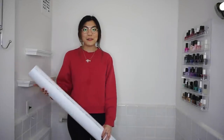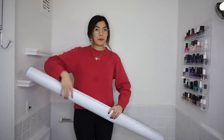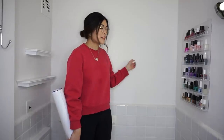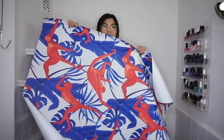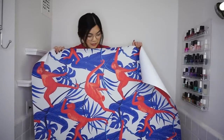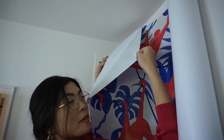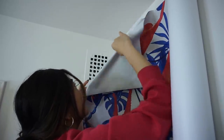Welcome to my bathroom! I'm on a little ladder which is why I look so tall. I'm going to wallpaper this wall right here — I tried to put shelves on it but I think it's concrete and I don't want to drill into it, so wallpaper is a great alternative. The wallpaper inside is very fun and a little crazy, but it matches the blue and white theme. The easiest way to start is to take a corner and fold back the edge.